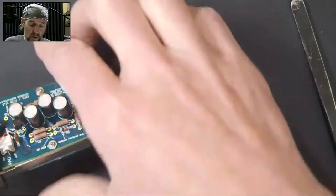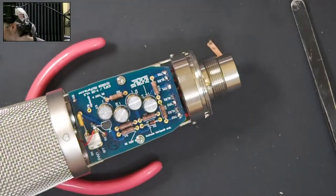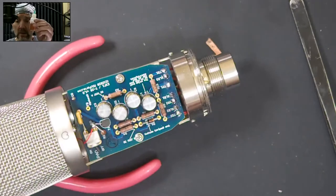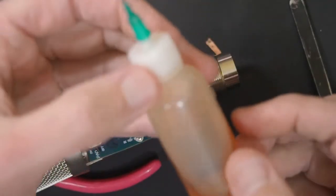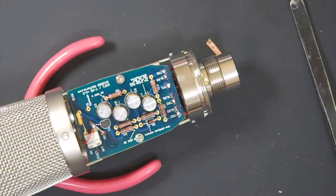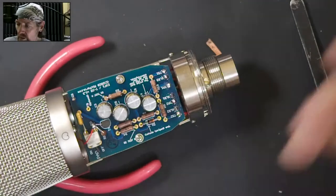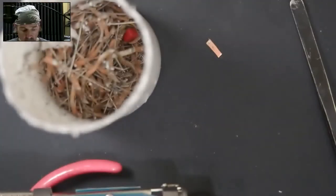The way I do that is with solder wick. This is a solder wick with flux inside it, which helps the solder flow. You can also get a liquid flux. Unfortunately you have to buy it in giant bottles. So this is liquid flux — great for desoldering and also for surface mount soldering. We take our flux-impregnated wick, clean off an end, and start here at the outside. The iron is hot. We lay the wick on top and remove the solder first. You certainly could just heat the joint and pull the wire out, but that sucks the solder into the through hole, which is not what we want.